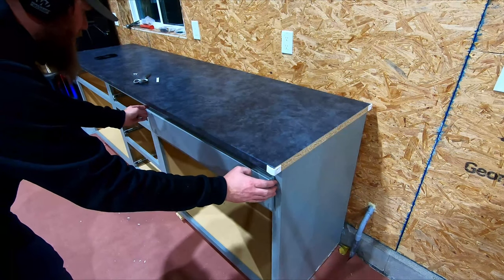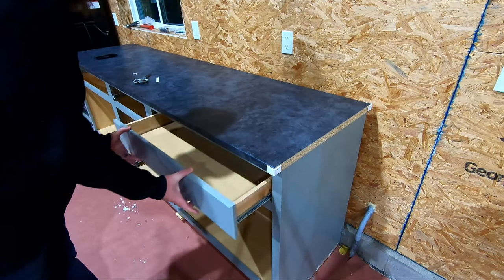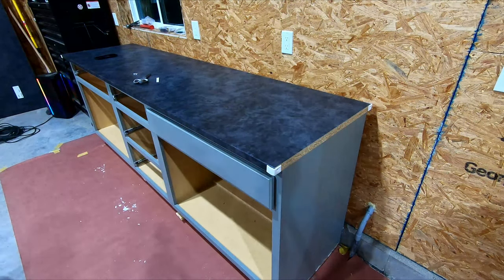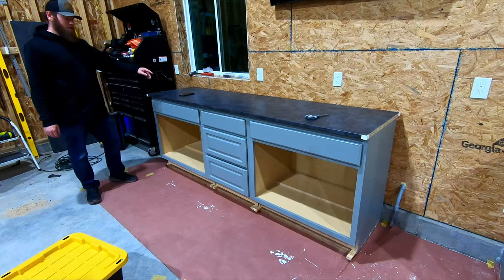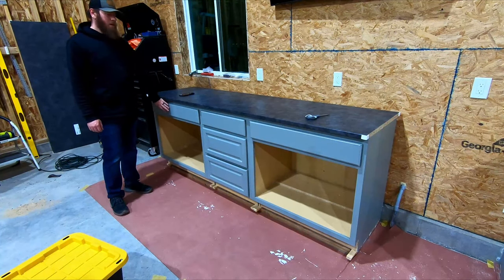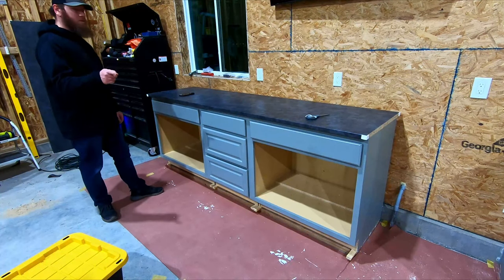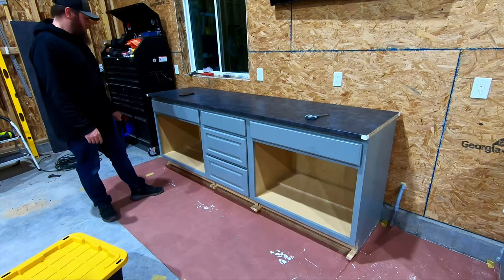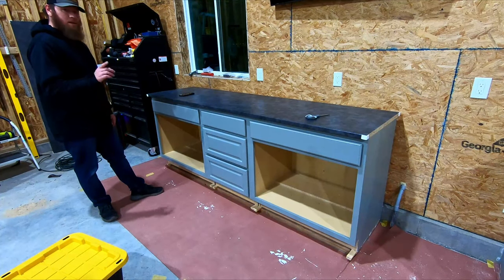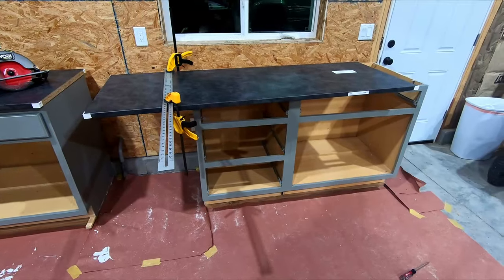All the drawers are in — I can even feel the paint is still a little tacky. I think it's looking pretty good. These are still slightly tacky so I'm hesitant to put the doors on right now since the cabinet doors were the last thing I painted. I'm going to hold off for the night and give the cabinets another 24 hours of dry time.